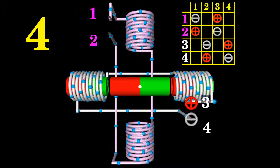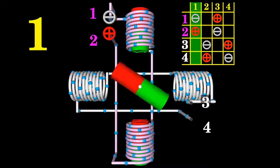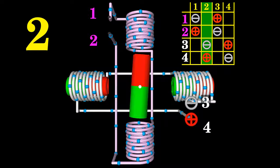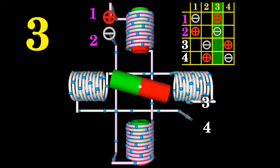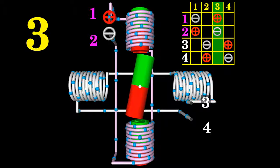The table lists the polarity of the motor terminals for each step. To make the motor continue spinning clockwise, you have to go back to column 1 of the table. The cathode of the voltage source has to be connected to terminal number 1, the anode to terminal number 2. Follow that scheme from left to right to make the motor spin another 360 degrees. As the windings are energized in sequence, the bar magnet synchronizes with the consequent stator magnetic field. The polarity at the terminals of both electromagnets is swept during movement — that's why this type is called a bipolar stepper motor.